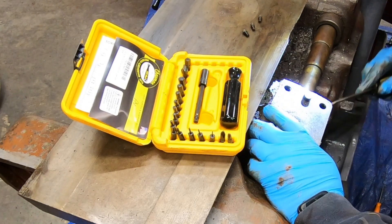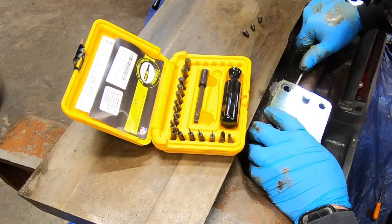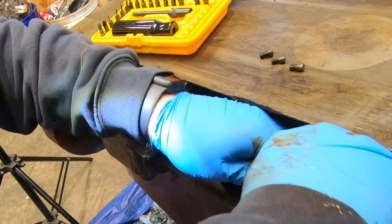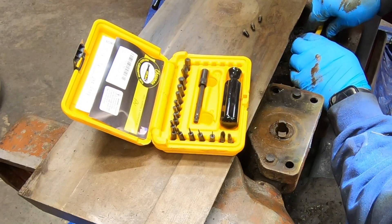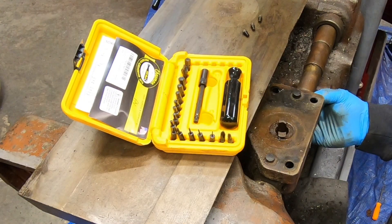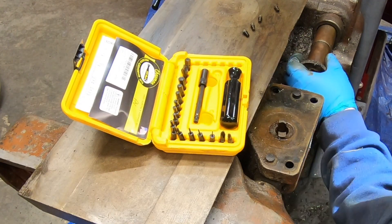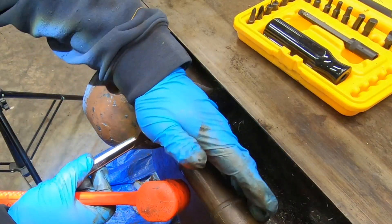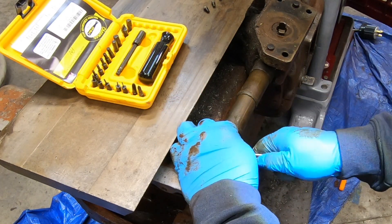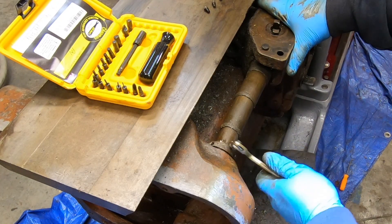Unfortunately I don't think I'm going to be able to remove the right side of the telescoping cover from the mill side. The parts diagram shows that there's an O-ring back there and some kind of retainer bushing that I'm not going to be able to get to from the front. I've tried working it out but I'm afraid I'll either do damage to it or won't be able to get it back in. The front side is a little more straightforward — there's a threaded piece in the knee that I just need to use this spanner wrench to unscrew.